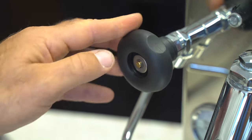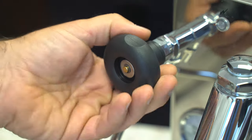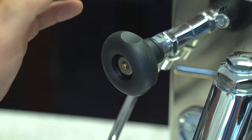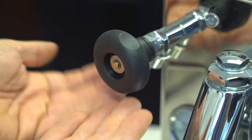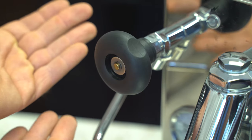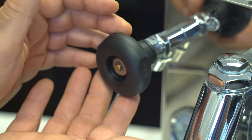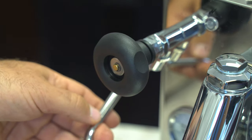As you can see, you don't want to over-tighten these knobs until they stop. If you look, they're loosey-goosey, and that's when the steam valve is typically closed. These are non-compression valves, so you can actually damage it by constantly turning the knobs tight. You want to turn it until the steam stops, then this pushes out when you open it up, and steam will come out.